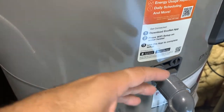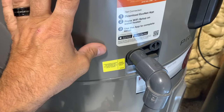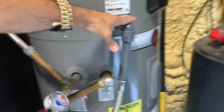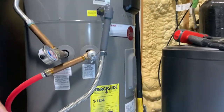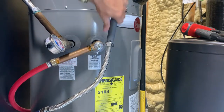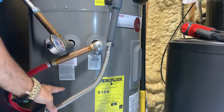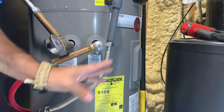If there's water pooled up inside, it'll touch that sensor and throw a code. If you're getting a code and there is no water inside, the sensor may be the problem. If I've taken this apart and established it's not inside the pan and not in this pipe right here, it's probably further down the line.